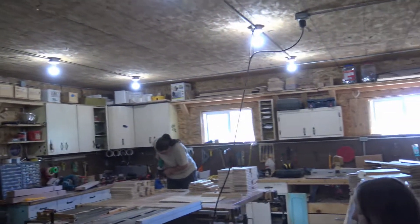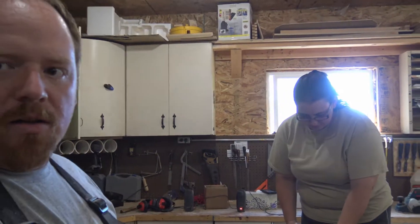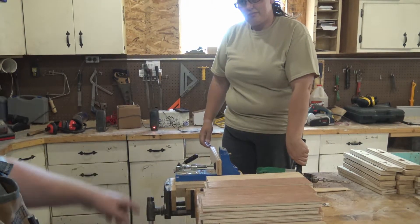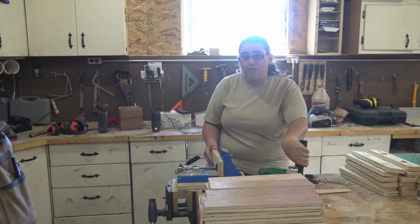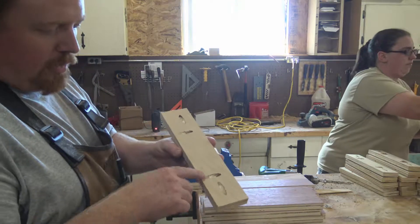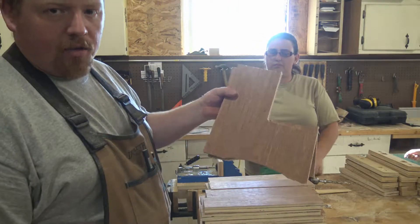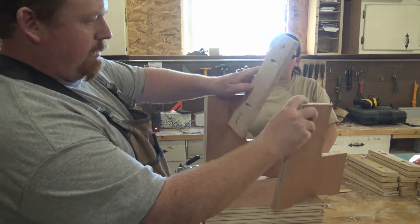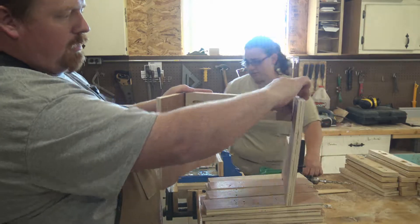Let's go over to the main part of the shop. We'll stop by where Jen is working and see what she's got going on. She's using the Kreg jig to put holes in some bracing that we're going to use for our two-step stools. What that jig does is it cuts an angled hole at the bottom that later we can go back and put a screw into. We cut these sides on the CNC yesterday. These get screwed together with the screw coming in from the inside of each of these.